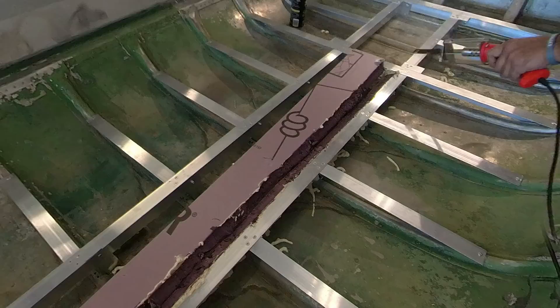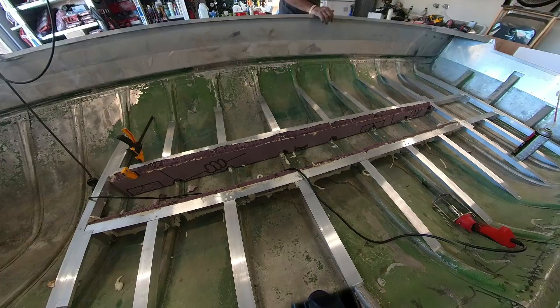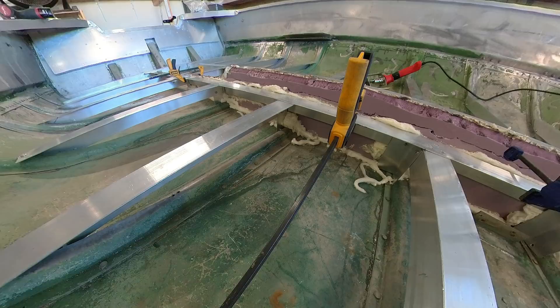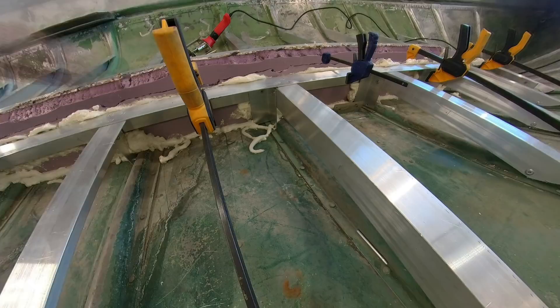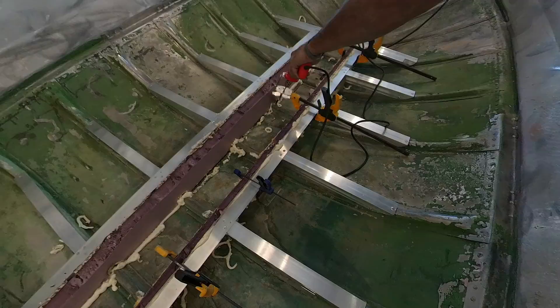Once we do that, I use a hot knife - really I should have just used a utility knife because if you just cut one strip down, this stuff actually just pops right off. That piece is already pre-cut when I got the sheet - it just pops off. I use the other side mounted the exact same way. The reason I wanted Great Stuff over the closed-cell quad foam is because it's stickier - it's a great adhesive for foam to stick to anything, including foam on foam itself. That's why I used it in conjunction with trying to seal all the gaps that would later bleed out pour foam.